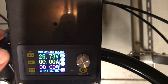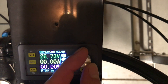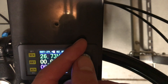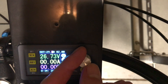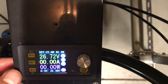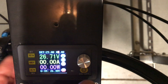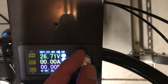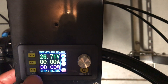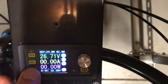Adjust the voltage with the top button, turn the dial, press it to change the fields and put it back to 29 volts with the volt button. Then to change the amps, just press the A button and then turn the dial. Let's say we want to go to five amps — that's how we set that. Put it back to two to start.